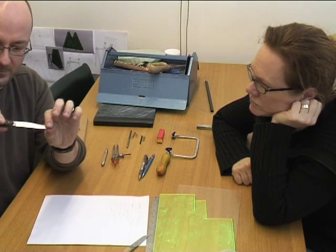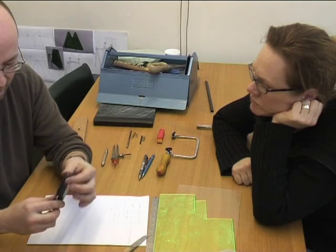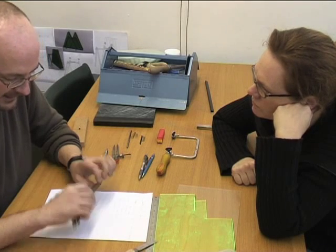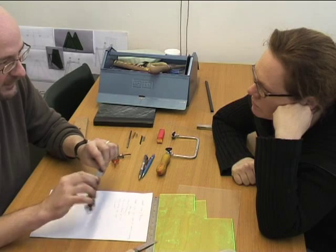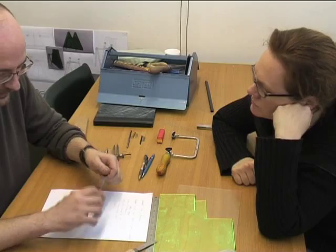If you look at that one, it's all over the place. If I make that any tighter with its little screw fitting, it won't close. The downside — and I'll probably go on to that later — is the bigger the pivot gets, you get more stability that way, but you've built more friction into it, so you still need more spring tension to get it to work because it's a bigger area.